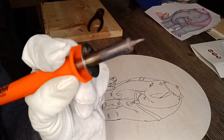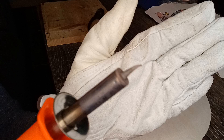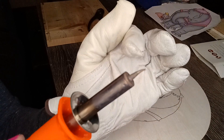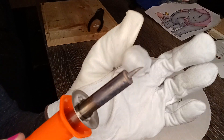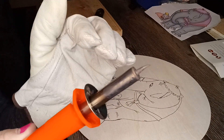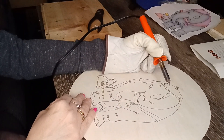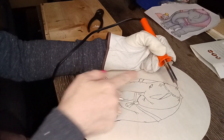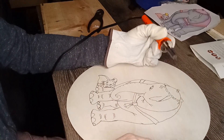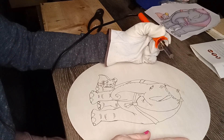This is the tip I'm using — it's got a little bend to it, which I like. But because it's so short, the stem part gets really hot too. If you're doing this, you have to do it at a certain angle, because if you put it down too far, that big part's gonna touch and burn into your wood, which you don't want.